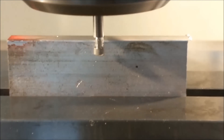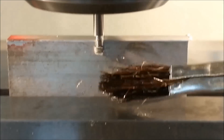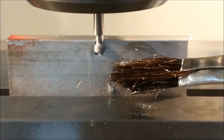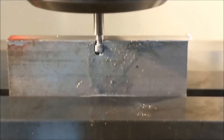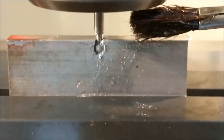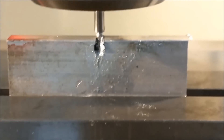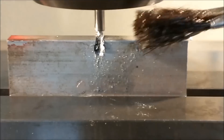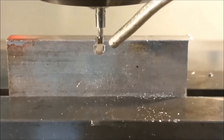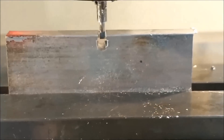It is highly recommended that you test your new cutter on a piece of scrap material and try to replicate the exact conditions you'll be using. That way you know the load the cutter sees here matches what it will see on the actual feature. One challenge with doing such a small feature on such a large machine is you just can't feel any resistance from the cutter — the machine is so heavy that moving small cutters through is really tedious on the first try. The chip it's kicking out is looking good — kind of sandy, but you're not expecting a long chip because it's not a helical cutter; this is more of a scraping type cutter, very sharp and aggressive because of the 40 degree primary. Take a look at the surface finish — if it's all torn up and smeared, you know it's dragging more than cutting.